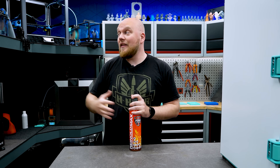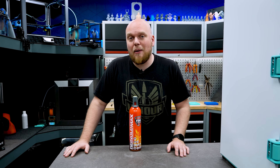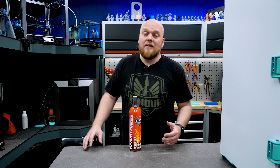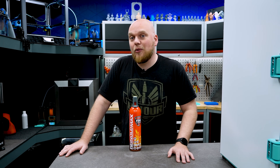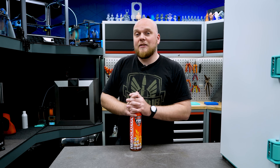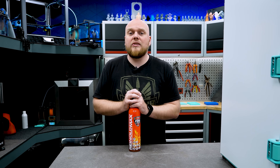The most important thing manufacturers can do to make our machines and homes more safe is implement thermal fuses. We all know regular fuses — if too many amps go through, the fuse pops, interrupting the power. The same thing can be done with heat. Most of the time the problem starts at a component, and judging by what the man on Reddit said, the printer was going through a thermal runaway — the nozzle or the bed getting way too hot and then the plastics around it catching fire. The printhead can perfectly house a fuse that pops when the temperature gets over a safe threshold.